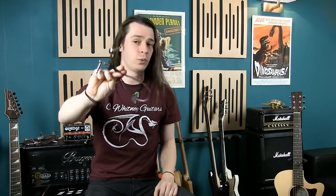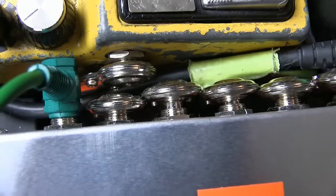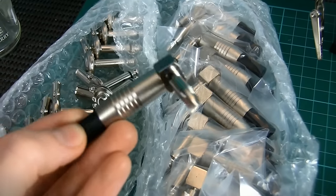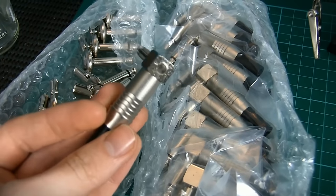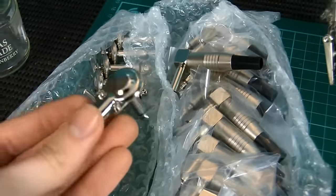I've got to make a whole bunch of them for my brand new loop switcher which I bought from Buzz Electronics. The patch cables would be like this one — purple PVC coated wire with right angle flat jack plugs. For this project they're going to be slightly different, because the connections on the back of the Buzz Electronics loop switcher are so close together that the circular connections are just too wide to fit comfortably, so I'm choosing to put those ends on these more narrow square type right angle jacks. The pancakes will still stay on the side with the pedals because that gets the pedals really close together on the pedal board.